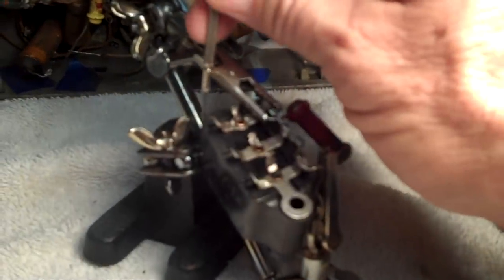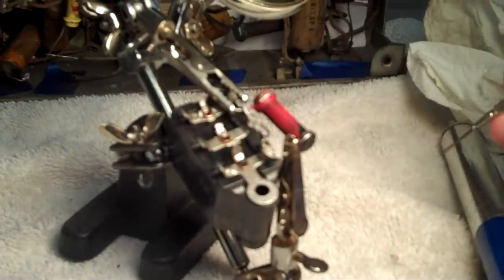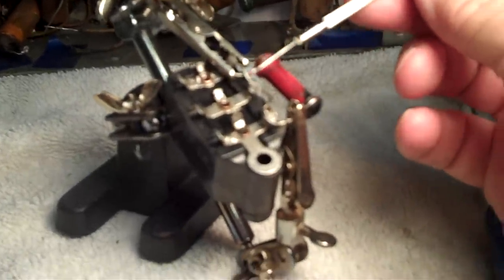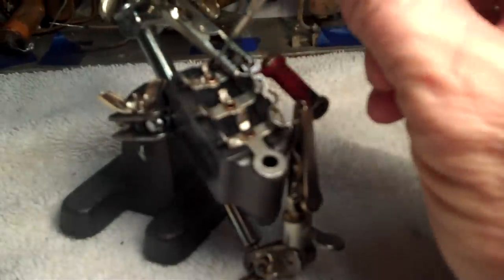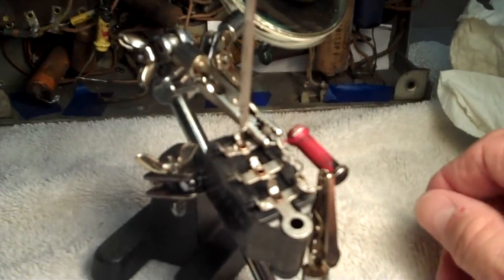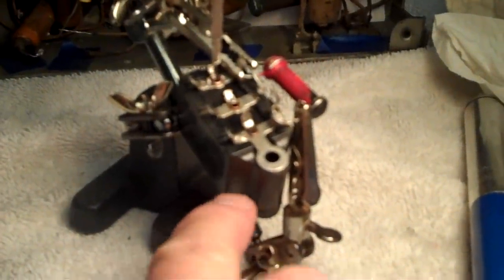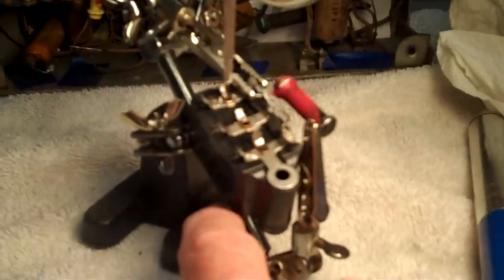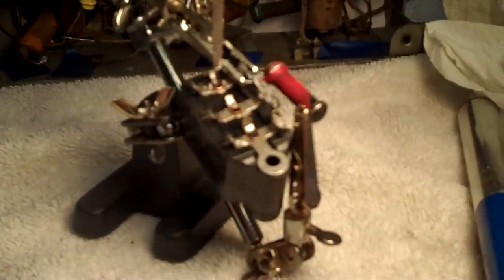But you have to heat it up on the back side, both sides, the end, round and round, get it nice and warm, and then you take your small jeweler screwdriver and push it down through these holes here and here or here, until you hit one of the capacitors that's in there. And when you push down, it's supposed to come oozing out. The whole thing is supposed to start coming out the bottom here. And once that begins, you're home free. It's just a matter of patience. But be careful, this block does get hot from the heat gun.